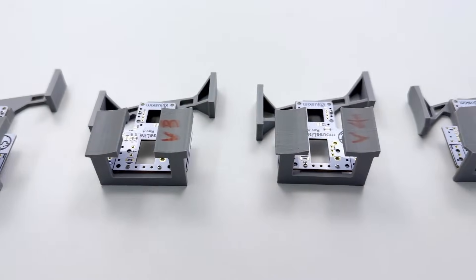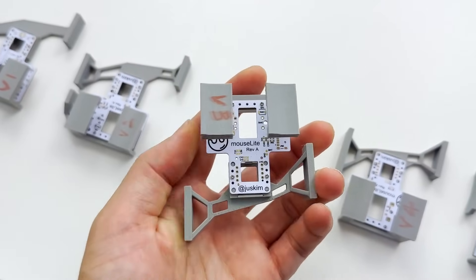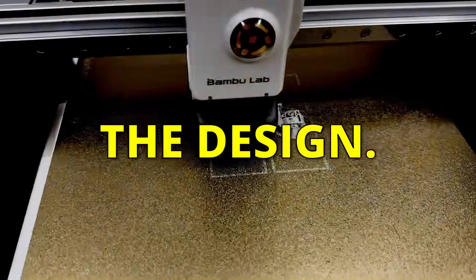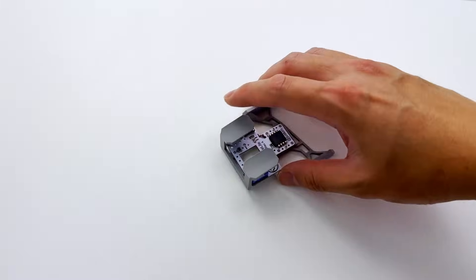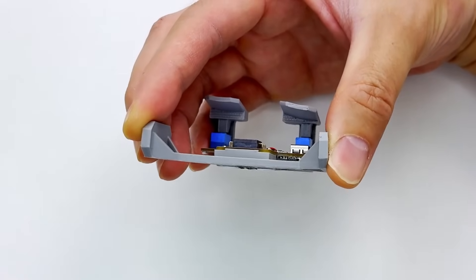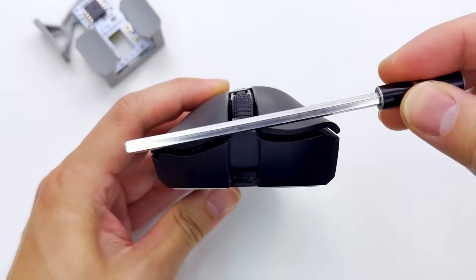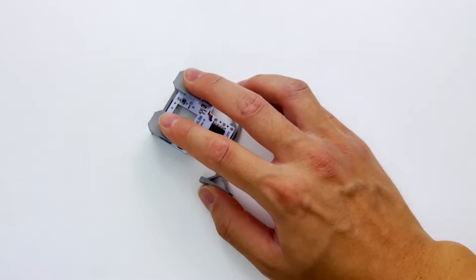Three days later — I've been busy prototyping the mouse. Starting from version 1, I changed the design for better finger positions and made it lighter with each revision. After all that, I ended up with version 5. I've hollowed out more areas to reduce weight while keeping enough thickness to prevent major bending. The left and right click supports have a slant profile, similar to my gaming mouse, for better ergonomics. Lastly, I added mouse feet to make it glide better.